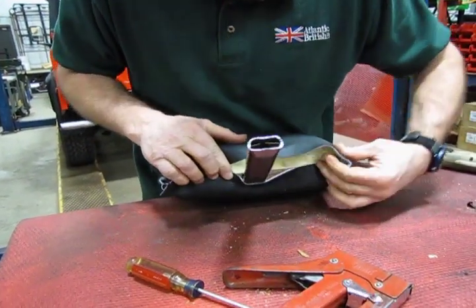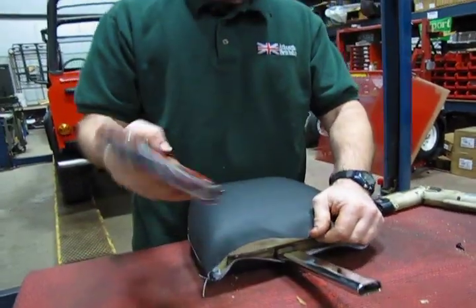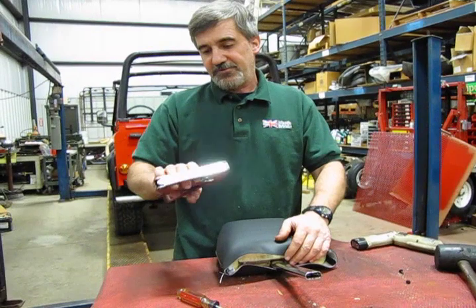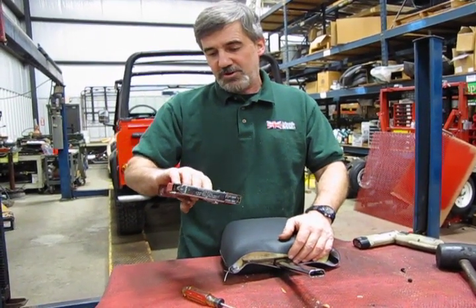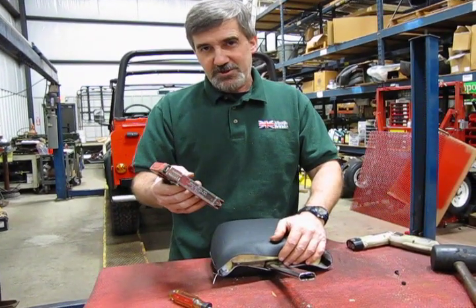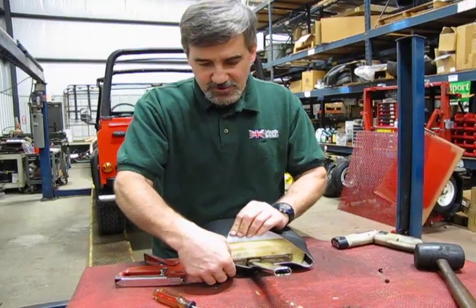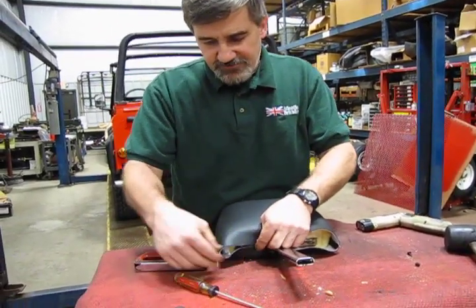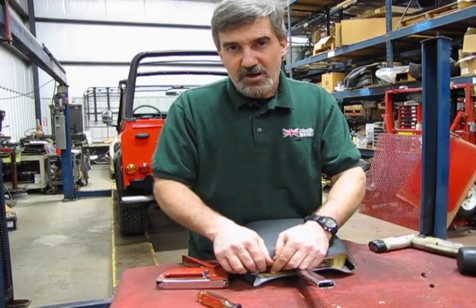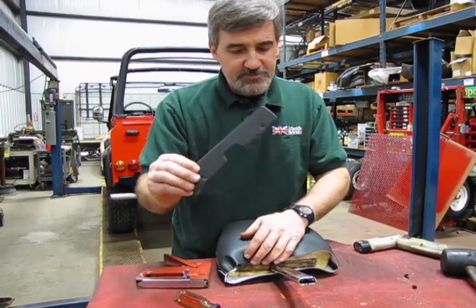Now just fold up, tuck the corners, and tuck the front. Use a heavy-duty staple gun — this is a Stanley, but any manufacturer will work. Don't use a desk stapler. Use a good heavy-duty stapler so it locks everything through, because it needs to go through two layers of vinyl, and in the corners you've got three layers. You want a good secure attachment. Once you're done, put your bracket back on and you're good to go.